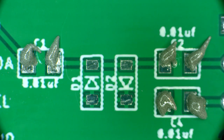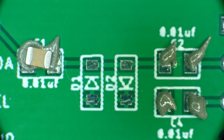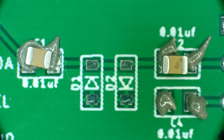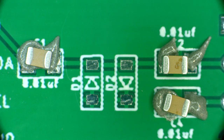Once you've got the solder blobs everywhere you need to, start putting down the parts. When you put the parts on, they'll kind of float above the board on the solder paste — give them a nudge to seat them down. You want them smashed down; if you don't smash them down, they can lift up on you. You don't need to be super accurate about placement, because the surface tension of the solder will pull the parts into place. We'll see that after the reflow.